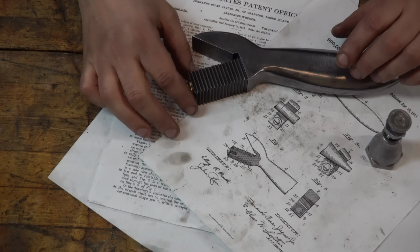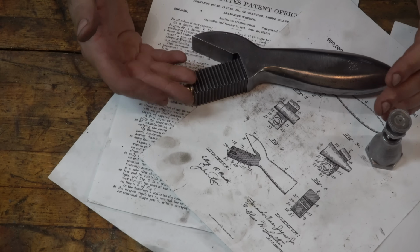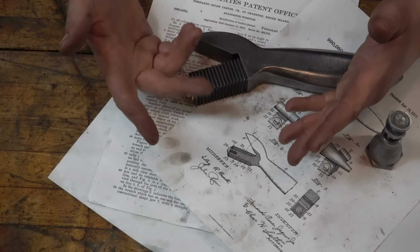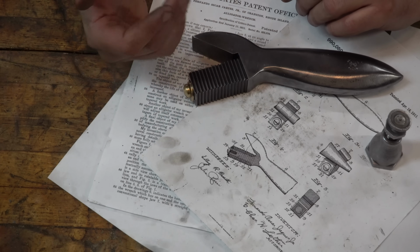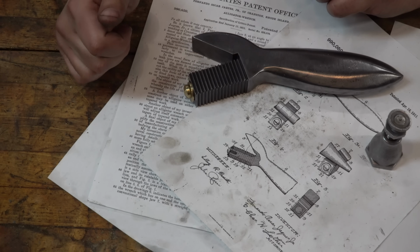The heat treating was fine. I have no idea how I magically ended up between 45 and 50 Rockwell C with some of these, with just flame tempering and flame heat treating. Yay, that was just pure luck. So you might not have such luck if you attempt to make something like this in your own shop.